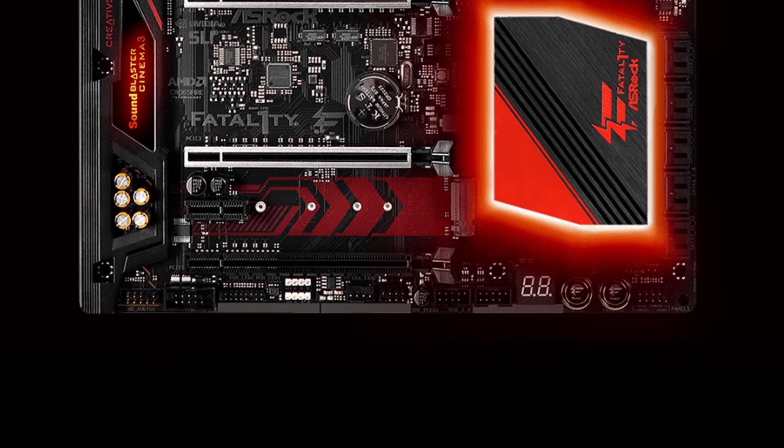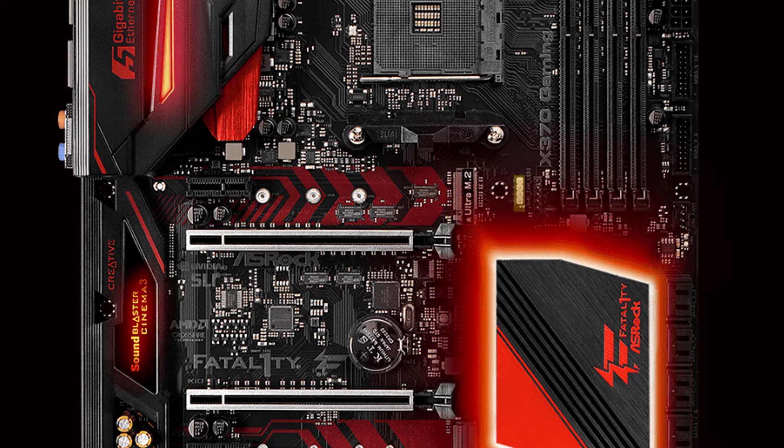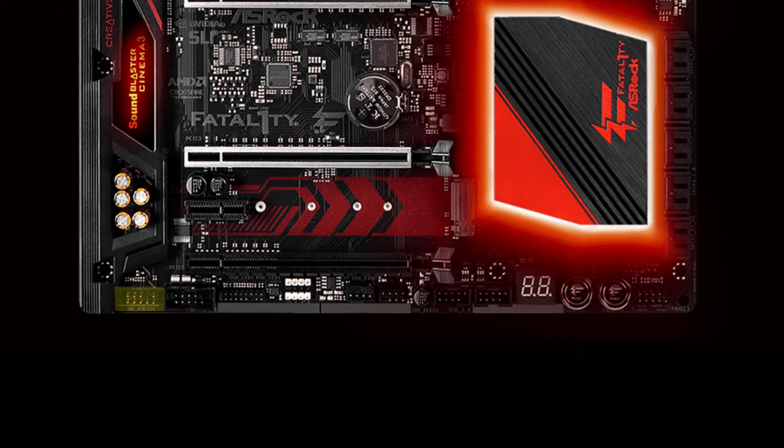Looking along the bottom from right to left, we have the power/reset LED header next to the power and reset buttons. Here we have two USB 2.0 headers and two of the three RGB headers. The third RGB header is for RGB-compatible fans — I'm sure it can be used for an RGB strip if you water cool, but it's in such an odd location it could make cable management a little difficult. All LEDs can be controlled via ASRock's RGB downloadable software. And here you have gold-plated front audio connectors, which is a nice touch.